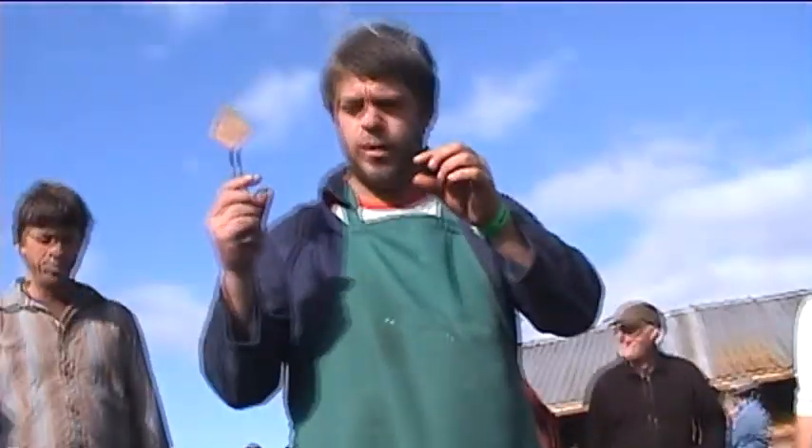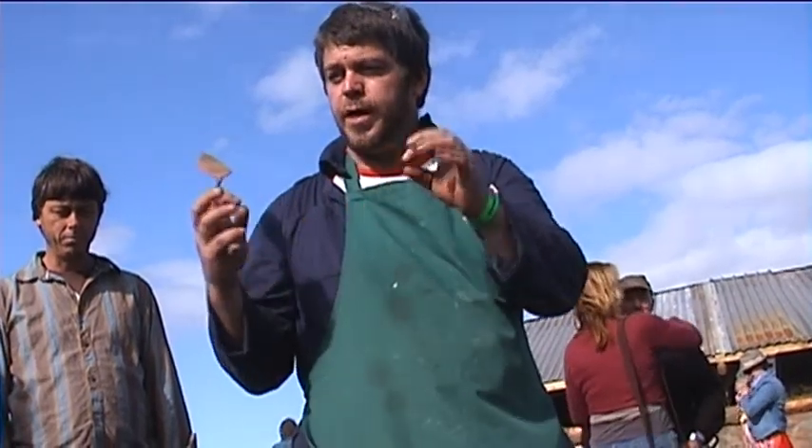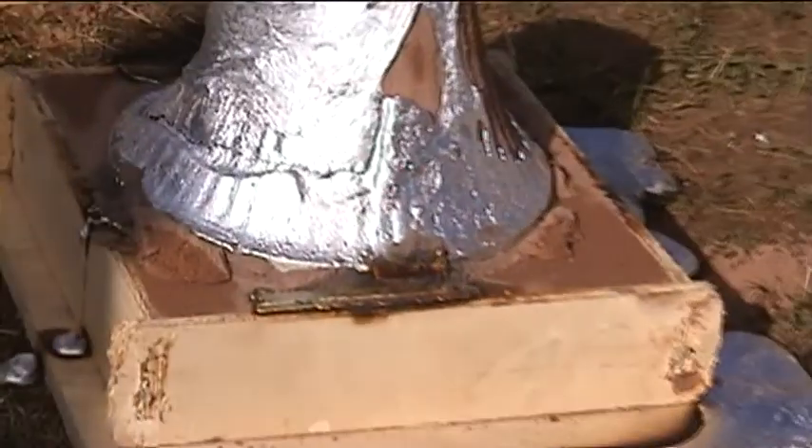It's not an exact science in that when aluminium gets very thin and it's out of its central blob, it freezes very, very quickly — exactly like has happened there. So it self-seals. The cooling self-seals.